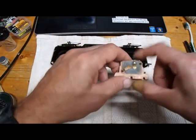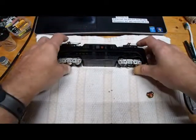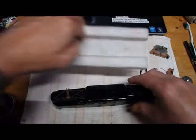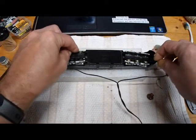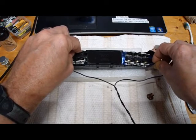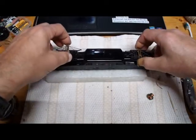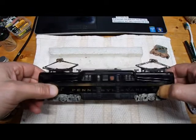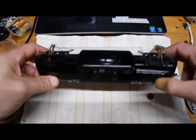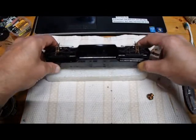Fortunately, from my donor I had some springs in here and that worked out just fine. I replaced the springs and I replaced the armature and it seems to be working. I got my lighting working properly. The pantographs on here are in pretty rough shape — kind of rusty. I don't know how much I can fix that up. Maybe I can find another body to get the pantographs from. Anyhow, let's take this up on track and see what happens.